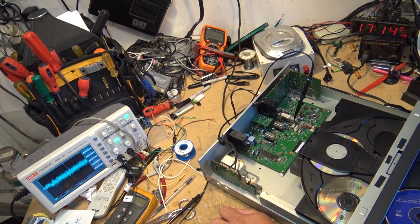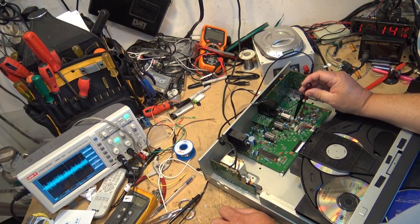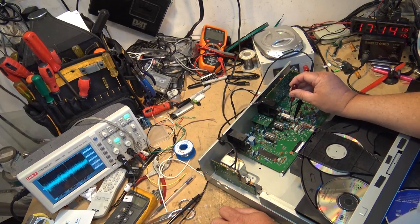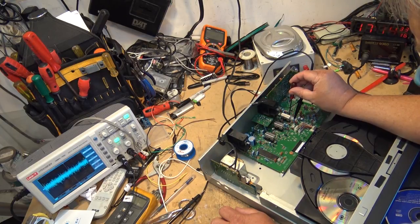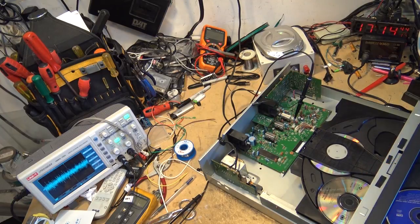So obviously I have to keep the sound turned down when the camera is running here, because I don't want to get a copyright strike. What I'm trying to do is minimize the fluctuations, the peaks that you see there. I'll be tweaking it a bit here, but I'm going to go off camera to do the fine adjustment, because I have to have the sound on while I'm doing that. We're going to try and minimize the peaks and see whether we can correct the fault on this laser, or the fault on this pickup. Aha. I'm going to play here and just let the CD play through.